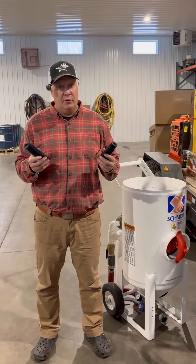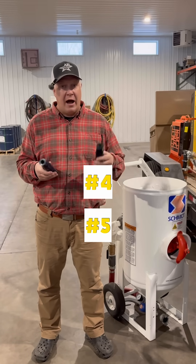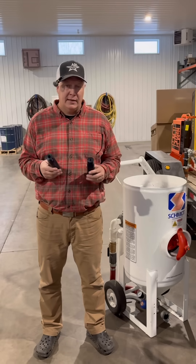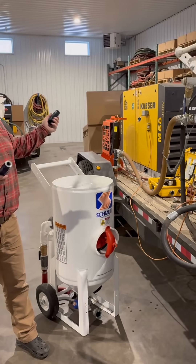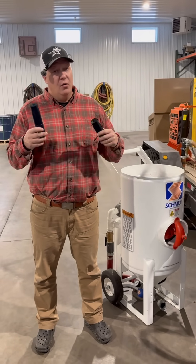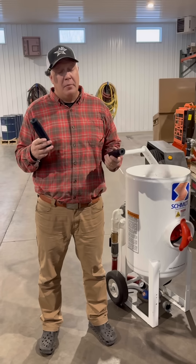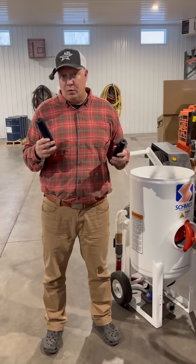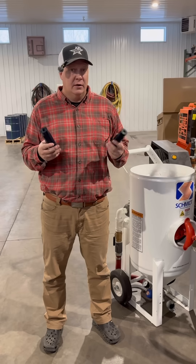For my test results, as you saw with the pressure, it is definitely going to be a benefit to run the ferrule flow with the number four, number five, and even a number six nozzle. You'll see in the final results our pressure did drop at the tip a little bit, and that's just because we're limited by the compressor size we have here for the test. I have a 210 Kaeser compressor running a number six nozzle with our air dryer hoods and everything else — we're just maxed out on air, trying to use more air than we have. You saw the pressure drop below 100, but that's not uncommon for many blasters out there. This is a pretty real-world test because all of us push our equipment to the max limits to get the job done.